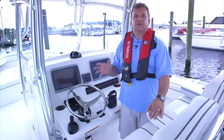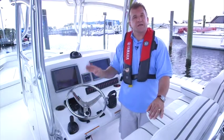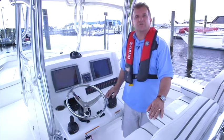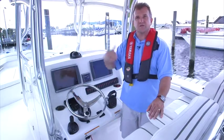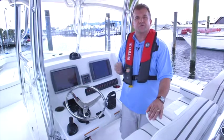It's best not to return to the center position, as that will unnecessarily bump you in and out of neutral. Rather than bumping the shift and throttle levers like you do with a conventional setup, simply continue to command the boat with the joystick in the direction and the amount of throttle needed to get to your desired point, until you reach it.